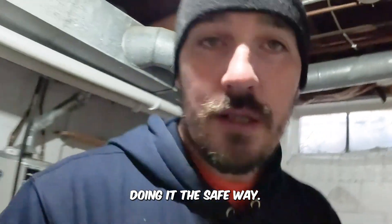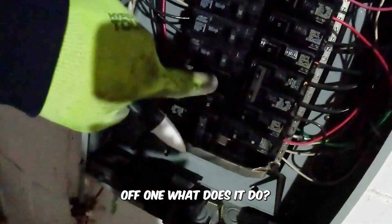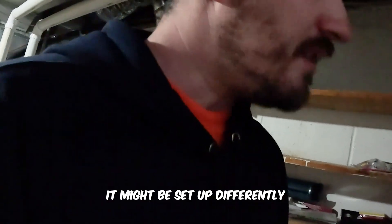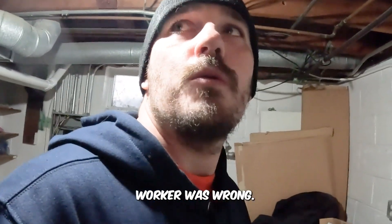That's why we are doing it the safe way. If you were to turn one off and leave the other on, that would send charge through the neutral, and whoever's working on that individual circuit could get shocked. Let's turn these back on. This one doesn't have any power going to it, but these do. Shutting one off doesn't do anything at the moment, but when you put any load on it, it's going to backfeed because it's sharing a neutral. It might be set up differently, so I'm going to have to dig a little further into that.